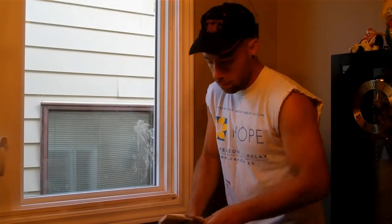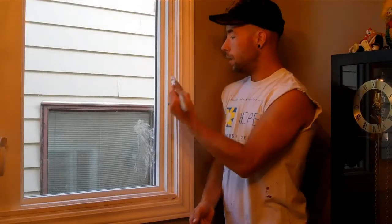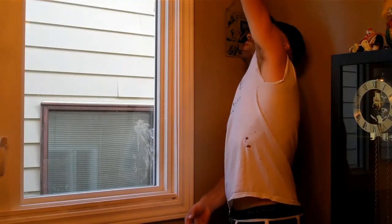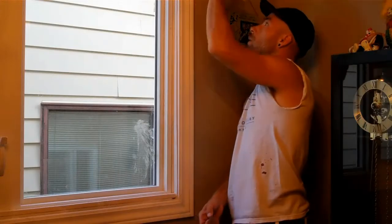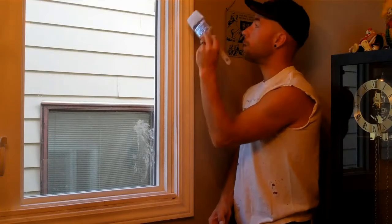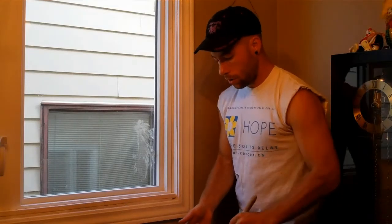New window, a bit tougher. Well, actually, you know what? Maybe it's not too much tougher because you get to set your own lines. So always remember this: paint the casing outside in. You always start on the outside and I'll show you why. You get a good stroke down here, paint the outside. What happens is you get a little bit of paint that comes off your brush, so when you come back down it's not going to be drying all bubbly and dumb looking. So let's work on this here.